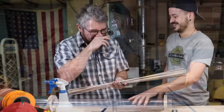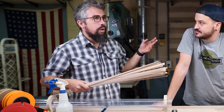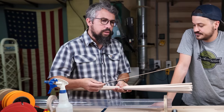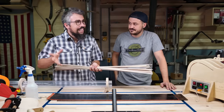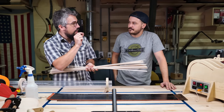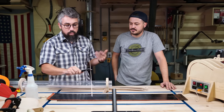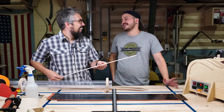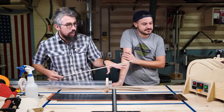What we do is take one stick of maple — probably an inch thick by three or four inches wide — and cut it into 36-inch pieces give or take. The trick here is being able to bind the guitar out of wood and make that hard cutaway, while still making it narrow and thin enough to actually make the cutaway. What we've landed on: the thickness on these is about 1.7 to 1.8 millimeters by 7 millimeters tall.